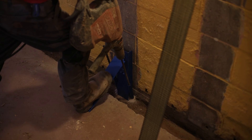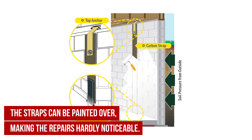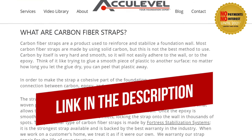On a general wall, you're probably looking at about two to four thousand dollars per wall. It's very important to catch walls in the early stages when you can use a carbon fiber strap to hold it, instead of waiting until the wall has pushed in further or, worst case, collapses altogether. If we're looking at a wall with a crack, pay attention to the other walls too — it may make sense to address those as well. To learn more about carbon fiber straps, check out our blog post for more detail. I hope this answered your questions — thank you for watching, and be sure to like and subscribe.